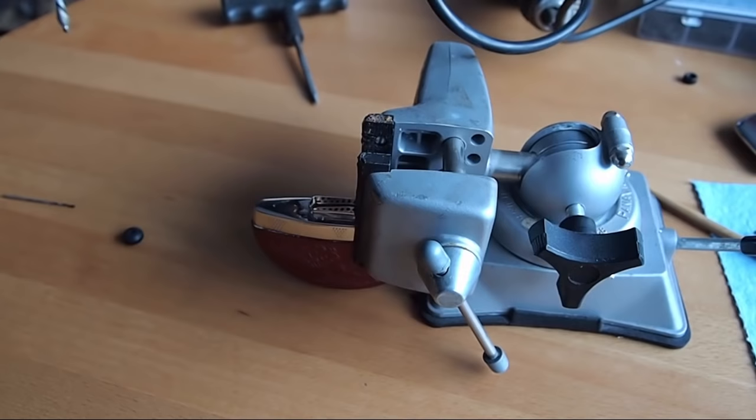When it comes time to make your large hole, first take the grommet you're using and measure it. I'm getting about 6.8 millimeters for the center diameter on this grommet, and I want to pick a drill bit that is slightly smaller — this one comes close at about 6.3 millimeters. I'll finish the hole off with the larger bit and then see how the grommet seats into that. Now you can see I've got the hole in the shoulder of the hand warmer unit. It's a bit rough on the edges, so before I put the grommet in I'm going to take the uni bit and just bevel the edges to smooth them out. If you don't have a uni bit you could use a file or use your imagination.